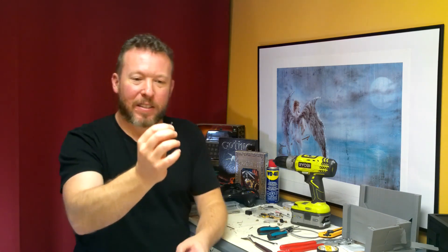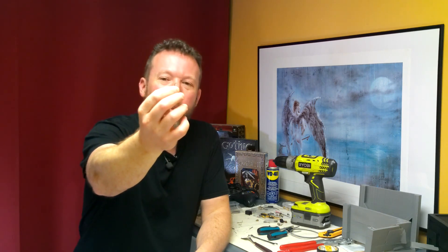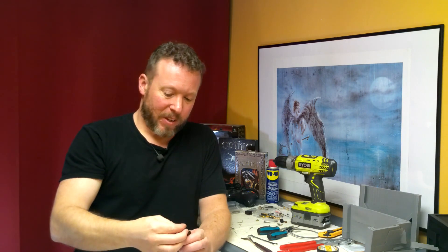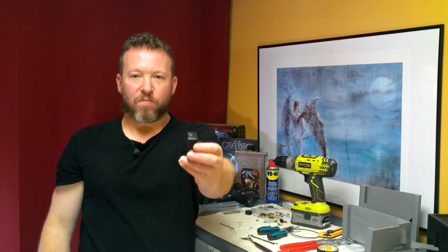So this time I was smart. I took the side cutters, went inside the spool and snipped the end off, hoping it would come off the spool nice and clean. But this tiny little hook — about the thickness of the spool material — got once again caught in the filament runout sensor. And my printer thought filament was still flowing through the extruder, so it kept on printing.